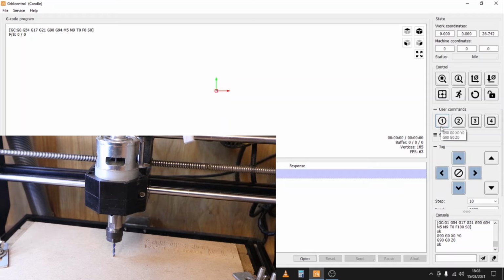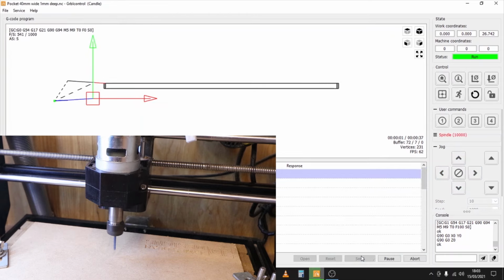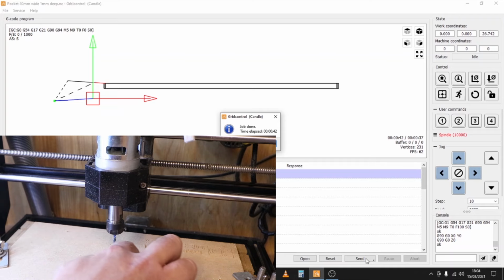Now what we're going to do as well is just run one quick test so we know that the depth that it's actually measuring is quite accurate. We'll come up to File and we'll go Open. And I've preloaded a 40mm wide, 1mm deep pocket cut. Again, test files will all be provided in the description area. So we'll click Open. And then we'll just quickly run this file. And what you should have is a pocket that is exactly 1mm deep.